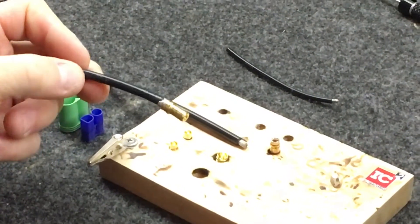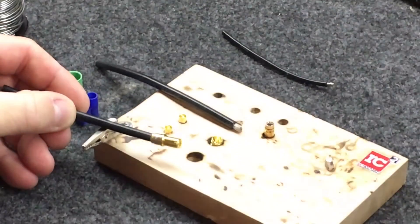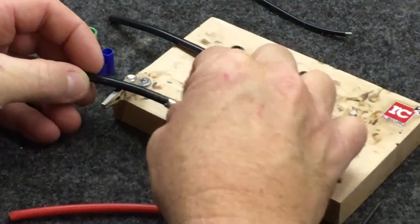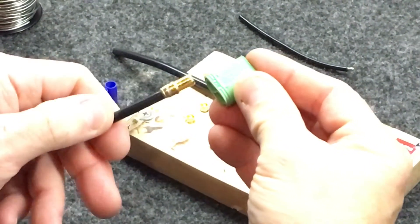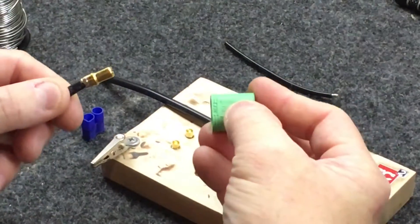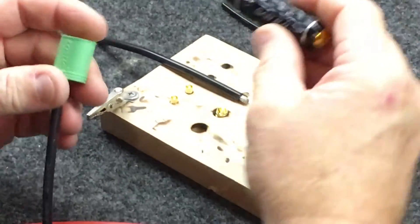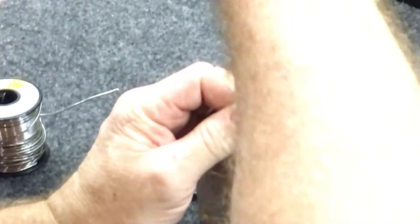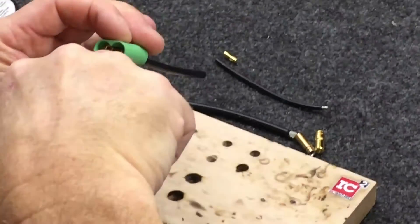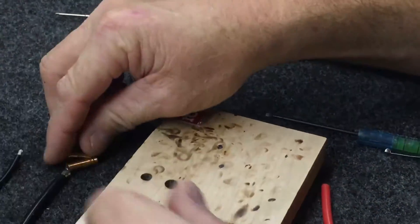You can see the steam coming off — that's hot. Once it's completely done, after I take the iron off, I let that solder rest. The Castle connector — you cannot push a connector up into a Castle from the front; it actually comes from the other side. So if you're doing just a piece of wire, you feed it through first. But if it's on a lipo, you're desoldering it, putting it in, and soldering it again. I use my 2mm SAB Allen to push it down inside, then pop it with my hand. Most people use a small mallet or wooden tool to drive it down.